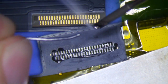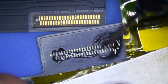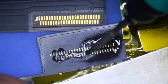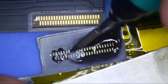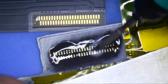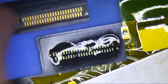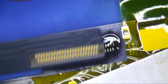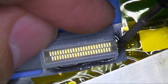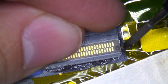I get a little flux and some 63/37 Kester solder. The gauge I use is about 0.03 inches — that's the diameter of the solder wire. You can use a smaller one but it gets a little annoying. You really just want to brush a little bit of solder on there — you don't want to cake it. Just enough so that you can get the solder to flow from the bottom to the top.